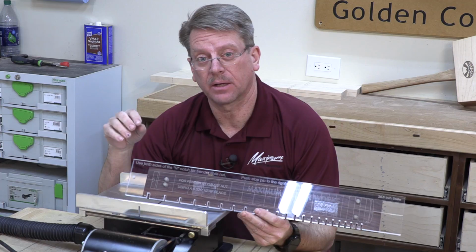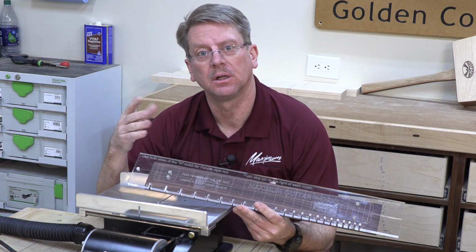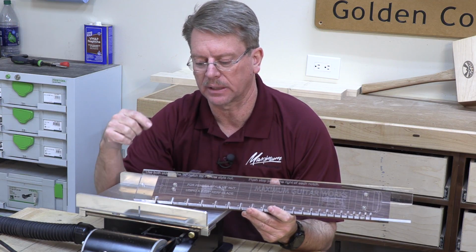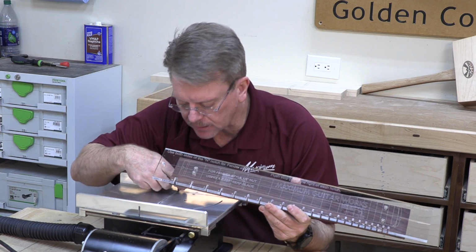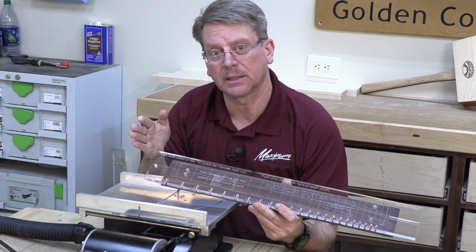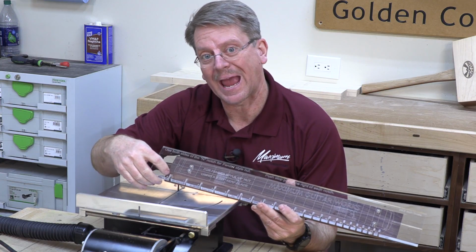One thing I hadn't pointed out is I made this fret slot cutting template specifically for the Fender style nut. So I've got double lines here on the etching, basically on my template, but that resembles this first notch out. And I've got a pin that is a locator pin, and for all of these notches, that pin is going to be shoved to the right side of the template notch, except for the nut line. And that one I will get the right and the left.